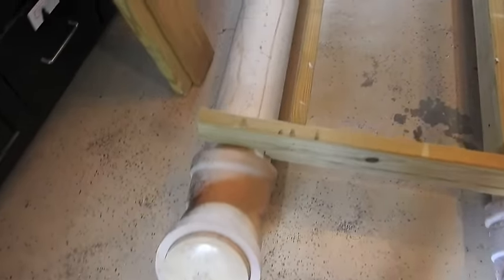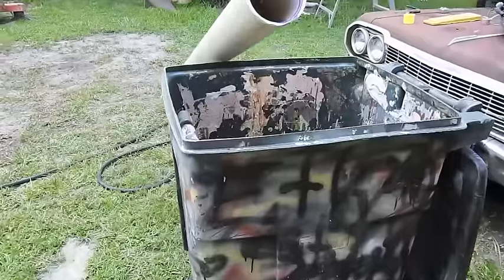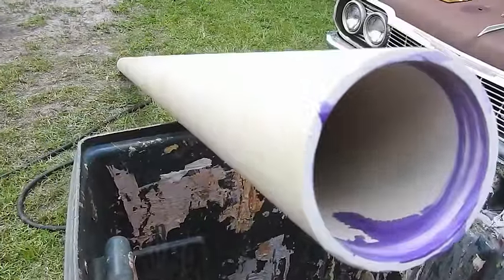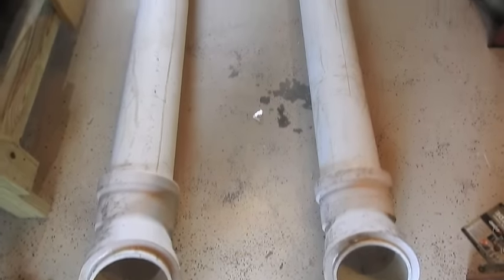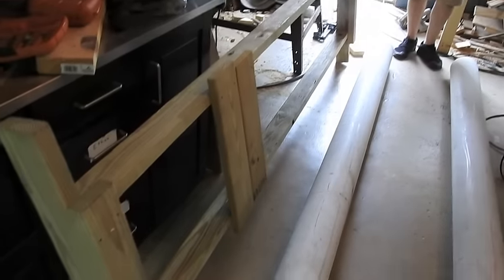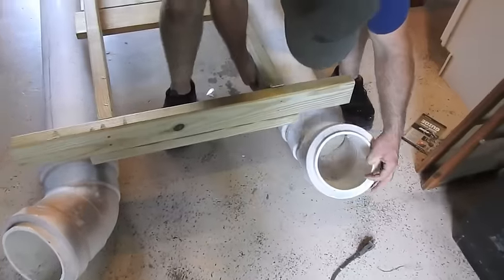It's about time to seal up these pipes on both ends so no water gets inside of them. And on the 4-inch pipe, he sprayed some foam up in there so it's all full of foam. This end's about to be capped, and they'll be done, ready to be mounted. Pipe fittings have been glued on. We still have to put the caps on, but up next we're going to throw the frame into position. Then we're going to fix the frame to the pipes.